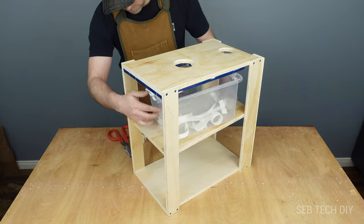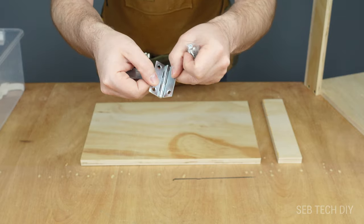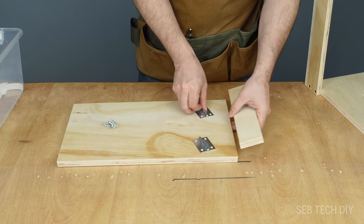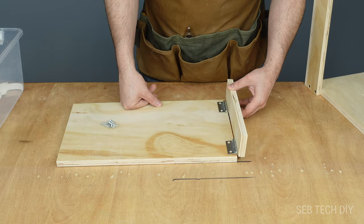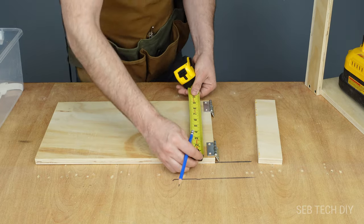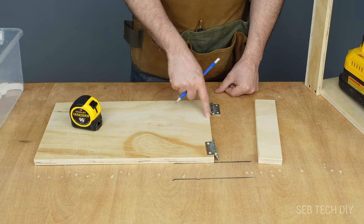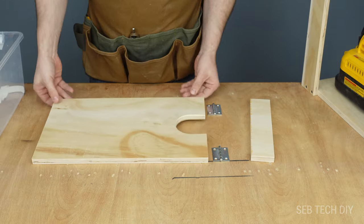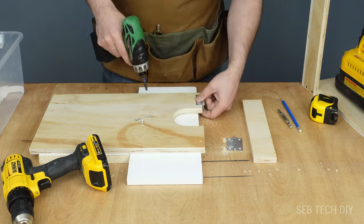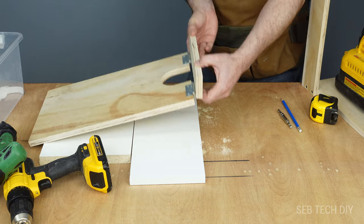The next step is to work on a shelf that will pivot to create some pressure over the top of the container to make a tight seal. The shelf will be mounted to a back support using two hinges, but because the hose of the vacuum will reach the dust separator on top, I've made a notch into the plywood to let the hose pass through the shelf. Once that's done I'm adding hinges to the rear of the plywood so it can pivot from the rear.